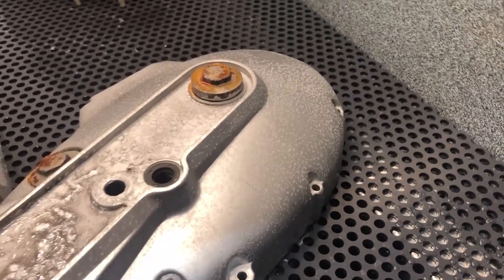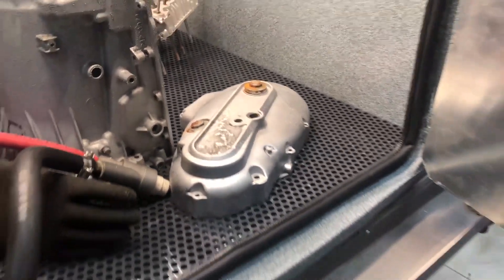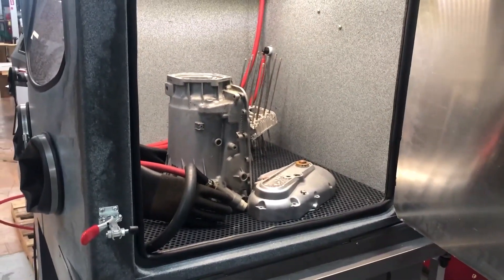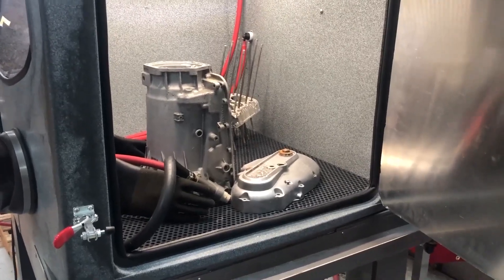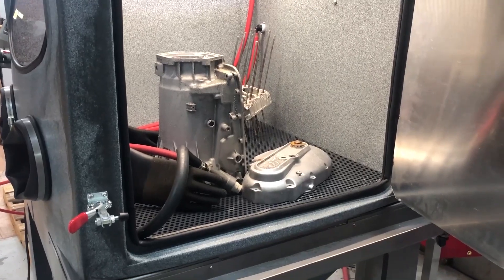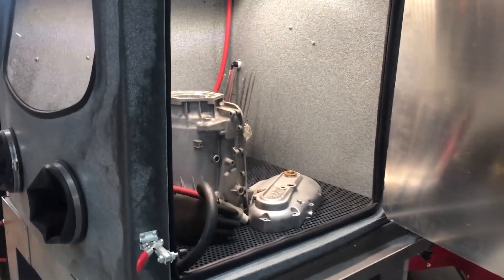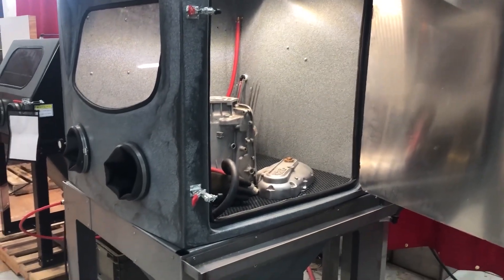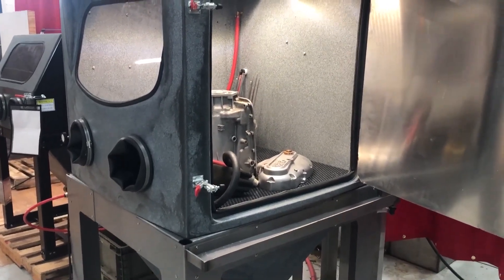You're gonna have to re-vapor hone it and waste a ton of time redoing the part. Look at that — that's what I wanted to show people: why you need to dry these parts off, and what could be happening if you get those light and dark spots. That means you have not dried the part off completely before letting it air dry. Hope that helps — if you have more questions, give the sales team a call or shoot them an email. As always, thanks for watching.